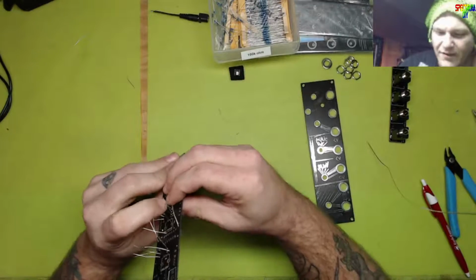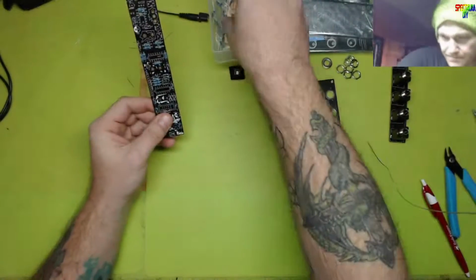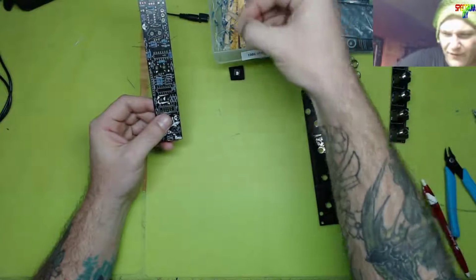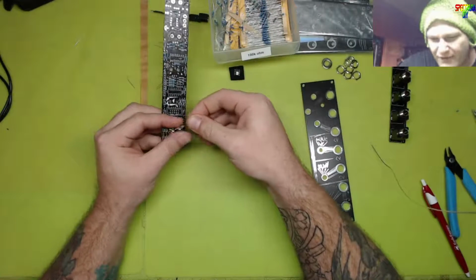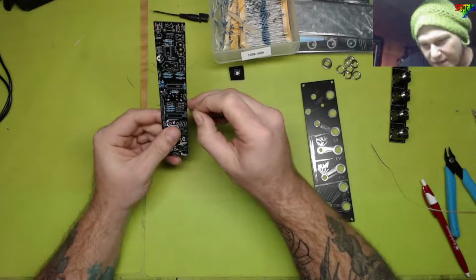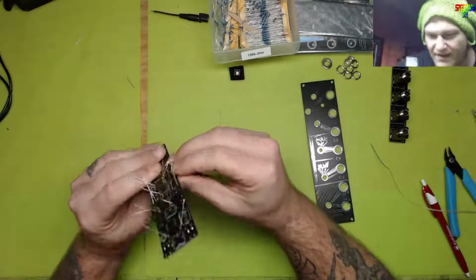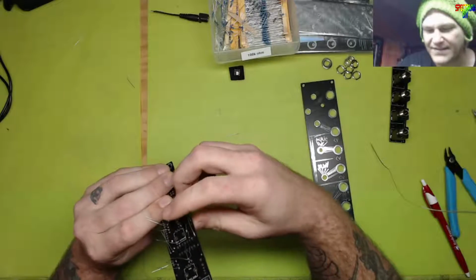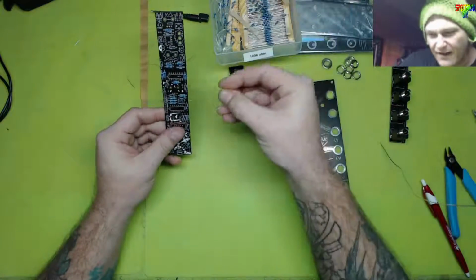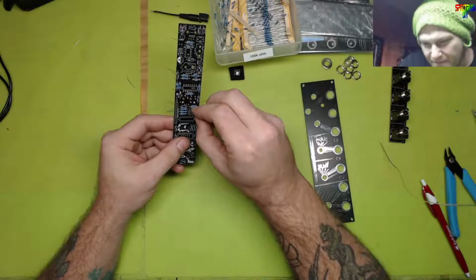If there's an Arduino in the mix, it's generally to tell you what the tune is. And you wouldn't be setting the tune based off of a resistance. You'd be setting it based off of an if statement check. So like, if the tuning is within the 10% or whatever. So you're still not gonna be exact, but if you can get within 5 to 10% tuning, I'd call that great. Especially with only one knob.